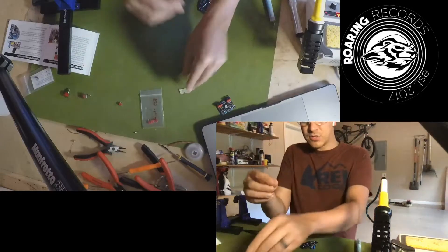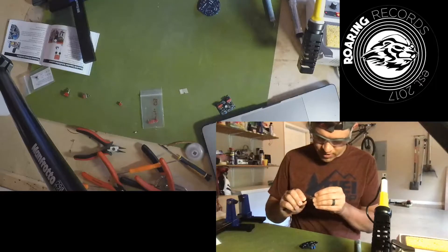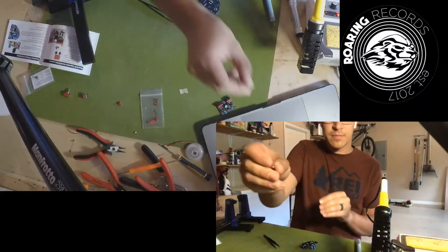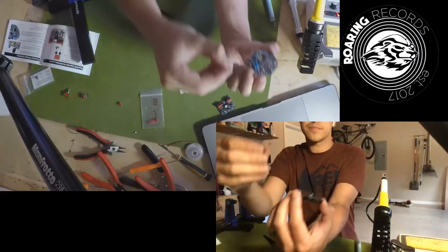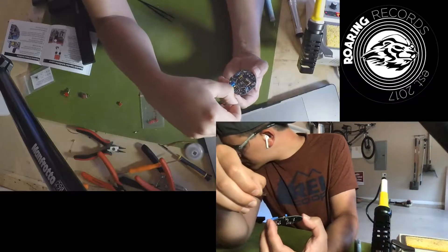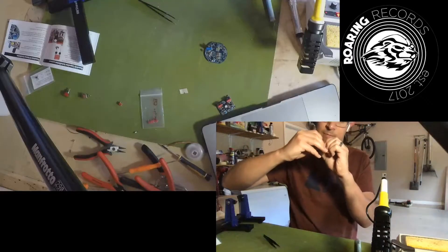We've got another transistor here. Take the middle wire and do a little friendly shaping to it so that it will fit down in the slots appropriately. Shape it so it kind of resembles the top of the transistor. It's going into the circuit via slot T4, so make sure we get all three wires and reshape it a little.